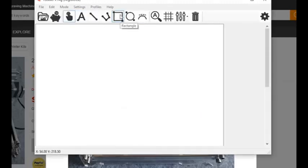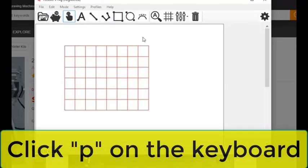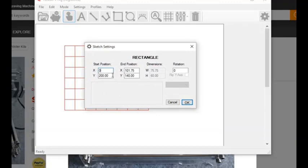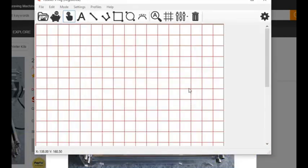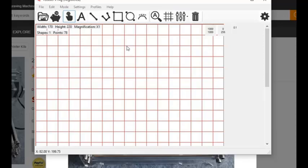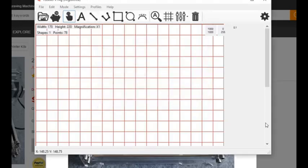We're going to select OK and then make a rectangle — click Rectangle and put it on the screen. Then we click back to Select, select the box, and press the P button — like Paul — which brings up the Properties window. We want this box to start at 0,0 and be 170 by 220, which is our maximum engraveable distance. It's always best to turn on the information overlay, which shows the maximum height and width so you can enter those under the end position for X and Y. Then select OK — now we have our grid.